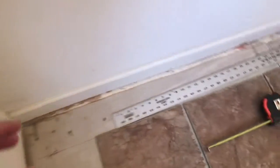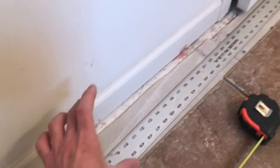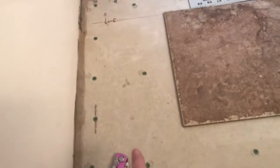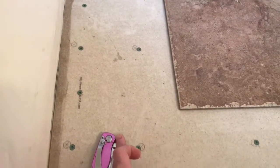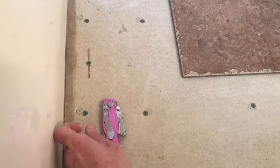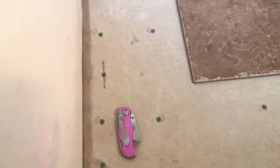And what I mean by dry laying is you're gonna think ahead, and these pieces right here are not bad, being that they're about 4 or 5 inches on that line right there. And then over here you have about maybe a 9 inch. And then if you figure your offset one is gonna be right here in the center on this line coming, those are gonna be about 7 inches. You don't want to end up at the tub and end up with pieces that are that big. It's gonna probably look like crap.